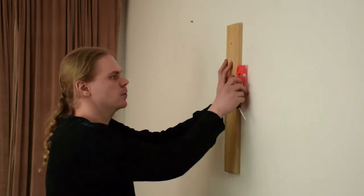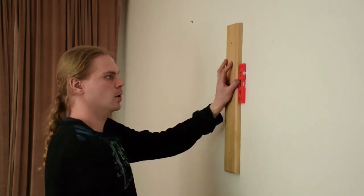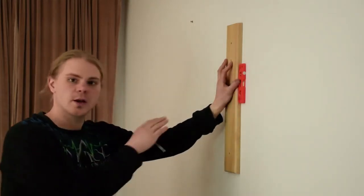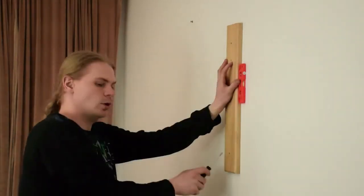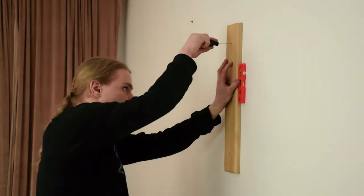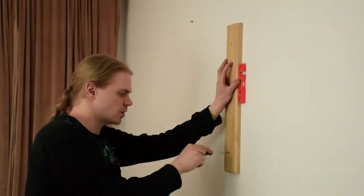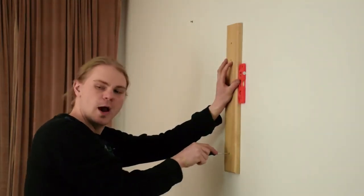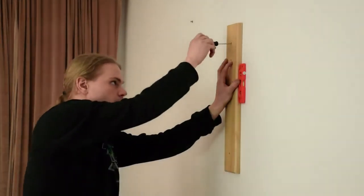Use a small level to ensure you're nice and straight. After you've decided on your placement and found the center of the stud, through the two larger holes, use a screwdriver to mark in the wall where you're going to install your gong stand. That way you don't have to measure and drill them just right — your holes are now made.